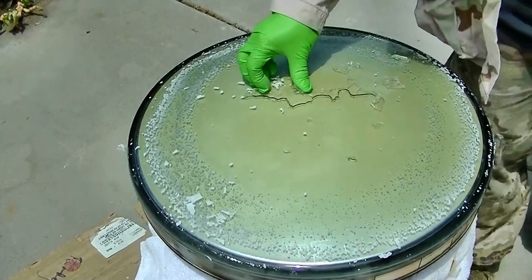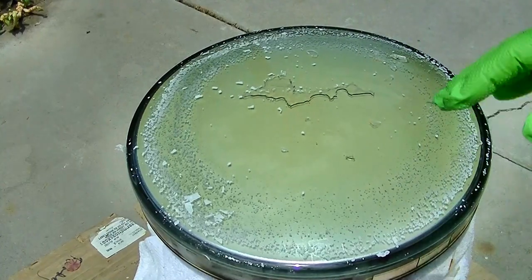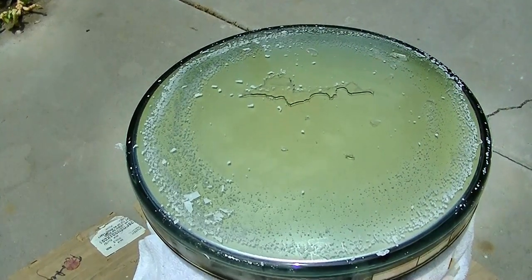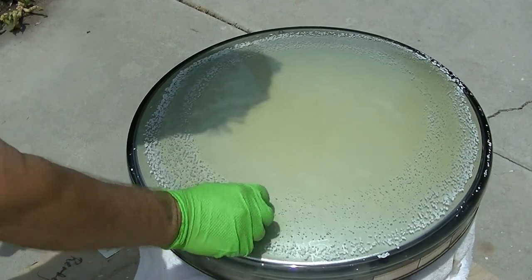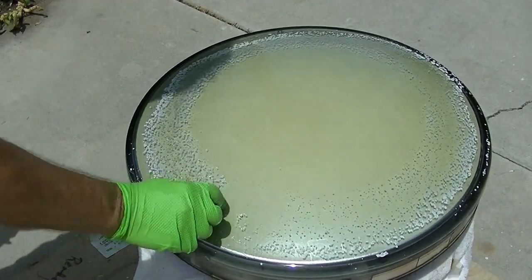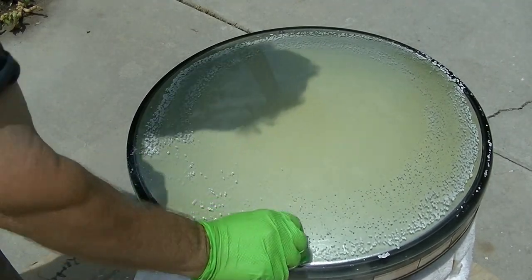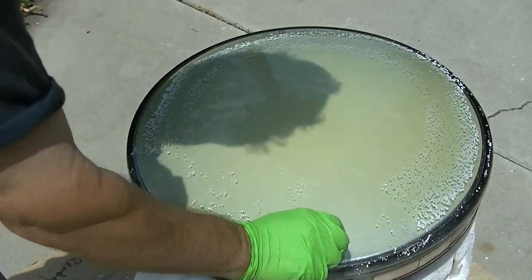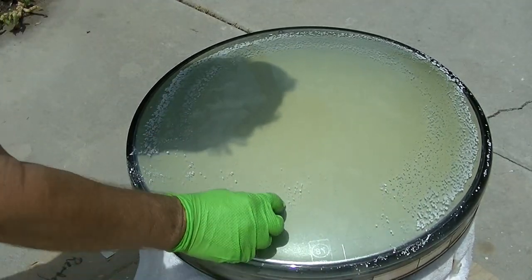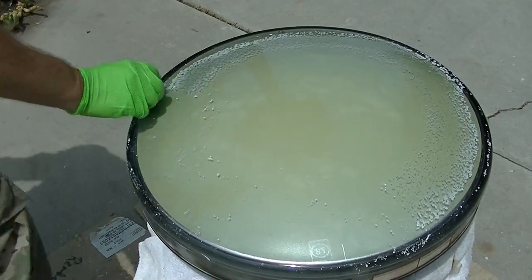Okay, I could clean the rest of this off. Wow, the CRT is real hot in the middle and it's colder on the outside. Let that equalize. Vacuum-filled pressure bulb. Once you're out, pretty much out of the danger zone. Once you get that off, I'm still wearing eye protection. I have my head wrapped up.